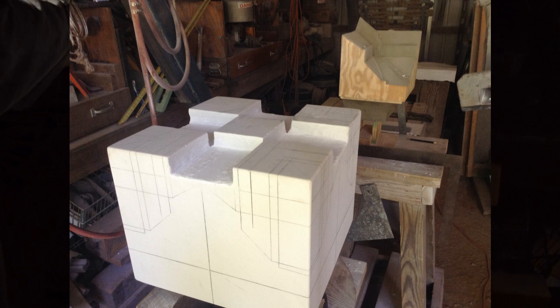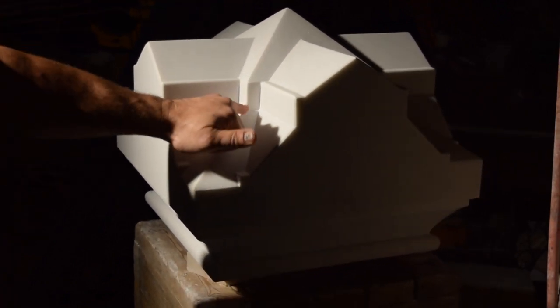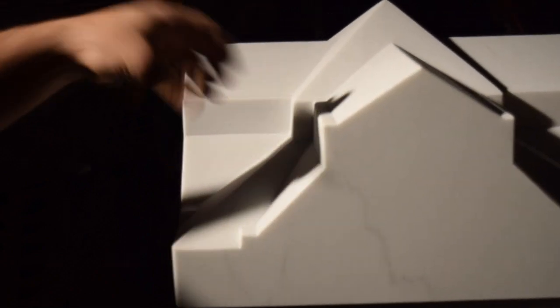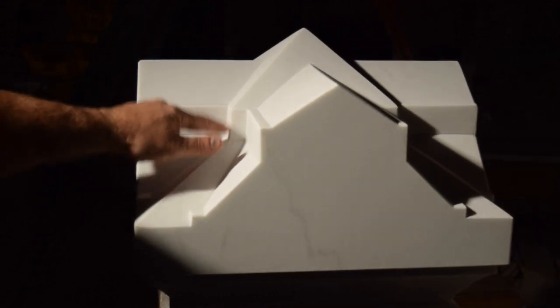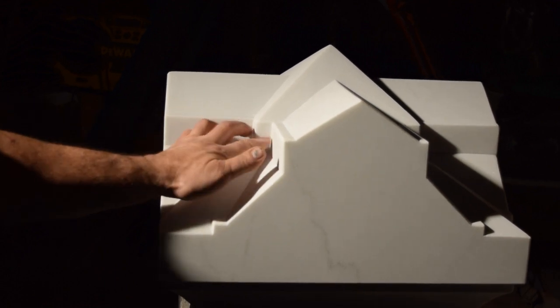So we started by producing these notches into nearly full depth, flat, flat, flat, flat. And after that, we started on the corners. Now, details like this step, this vertical plumb step, same thing, you can't just start carving and hope you land there with all this having to line up. So while I had nice straight references, we cut the corners out in blocks and opened them up. And what that allows is that interior corner, that edge is the interior corner, and then later on you'll cut the stone away to leave that corner so it becomes an edge. And that same type of work was done all the way through.